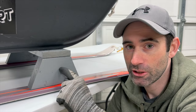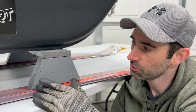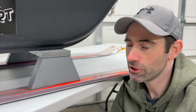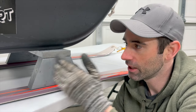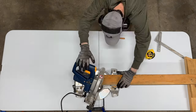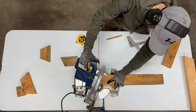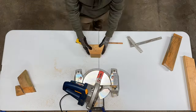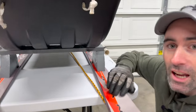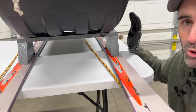It's finally time to start building. The first thing we've got to do is cut the four two by four supports that connect the skis to the struts. On this one I built last year I gave it a bit of a taper — I did that just because I like the look of it. You could just as easily square cut a piece of two by four and it'll work just as good. My cuts are at a 22 and a half degree angle, but use any taper that looks good to you. I also made the top of the support three and a half inches wide to match up with the width of the strut that goes on top. The struts offer some flexibility — you can make them as wide as you want depending on what you're trying to achieve.